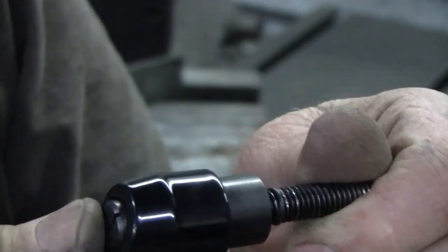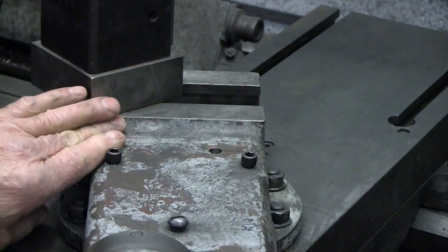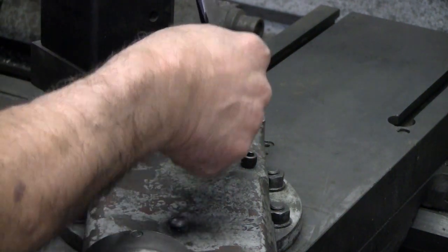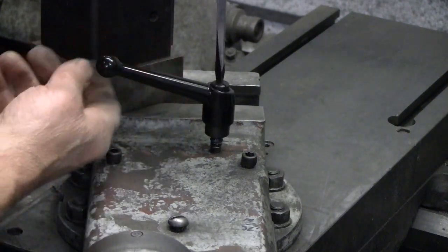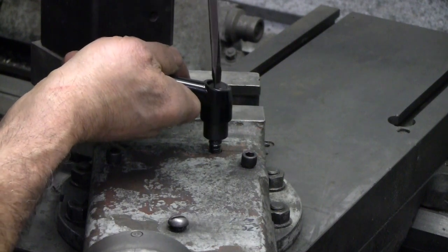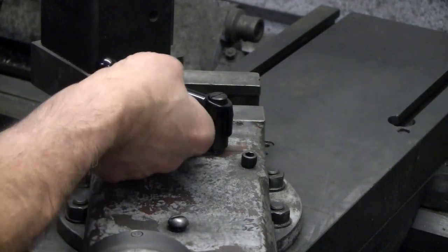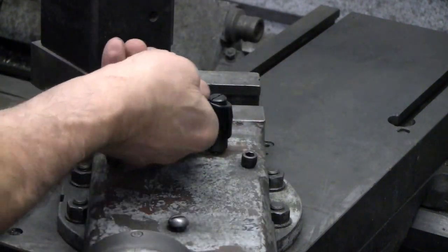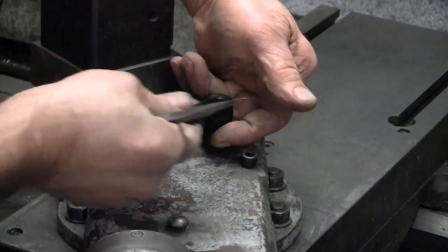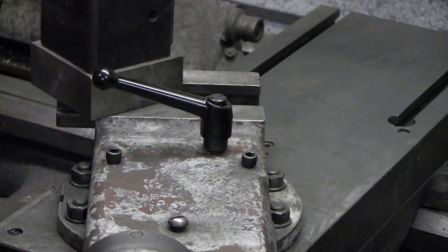This is a spring-loaded arrangement. You can pull this handle up and turn it and index it to any position you need — that's important here because the tool post is in the way. If the tool post weren't on here, I could swing it all the way around. What you do is pull up and use a screwdriver in the slot on the top to run it down until it gets close — and there it is, that's tight. I can pull this handle up and shift it around anywhere I like, and it will register in that position. That's bound up pretty nicely.